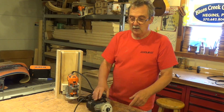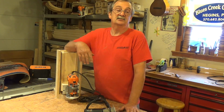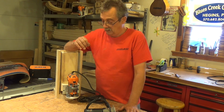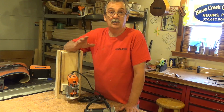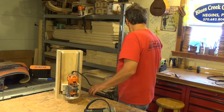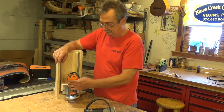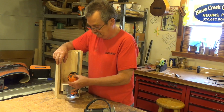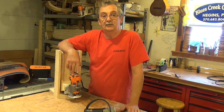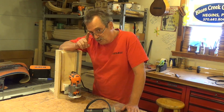Now, depending upon what kind of wood you're dealing with, hardwood, spruce, whatever, I like to cut the spruce at a little bit slower speed than I do a hardwood because you can burn. So, something that you're going to figure out as you go and play with it. My recommendation, you can hear it, you'll hear this thing change when you turn it on. And just play with it. High speed is good, but concentrate on this one thought.